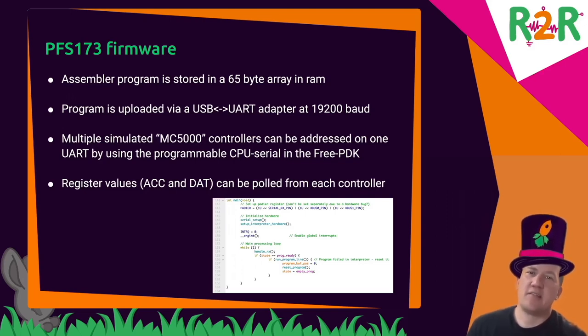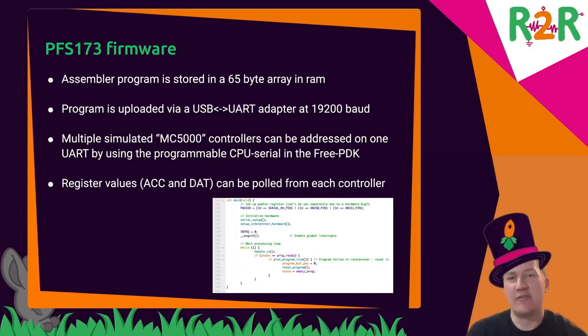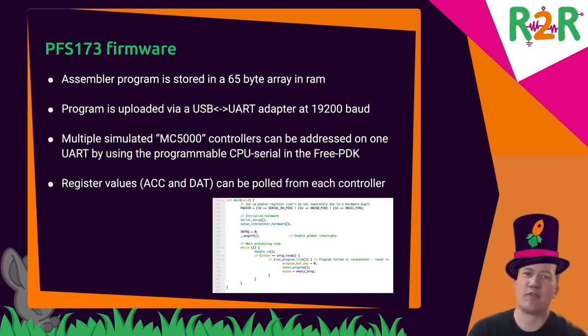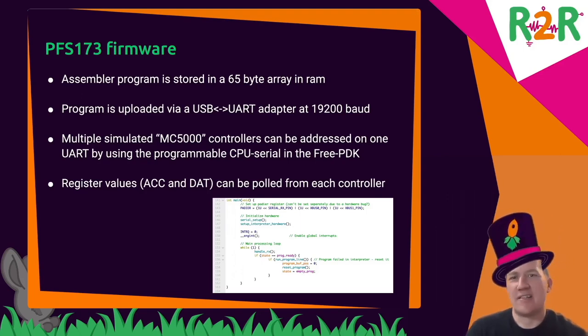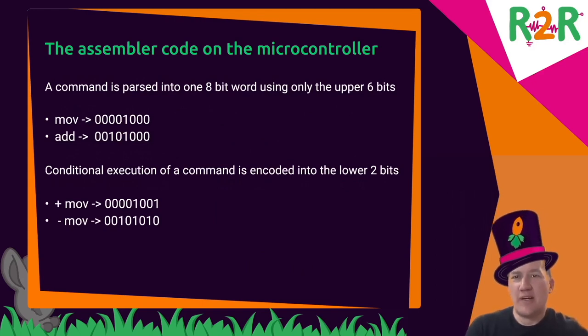What really helped was the compiler, because it actually was optimized for this architecture. In particular, function calls were using less RAM than before. And so I learned a lot about when to inline functions, to decrease their memory use. The SDCC compiler is not very good at figuring that out automatically.